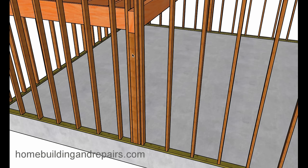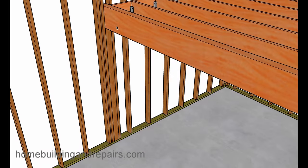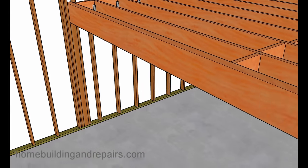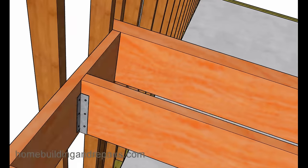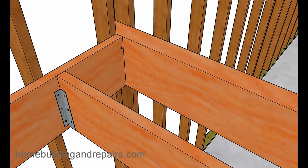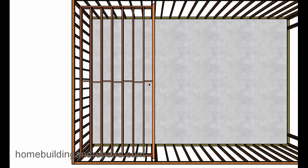You might need a six by twelve, might need a bigger post in here. Don't forget that you might actually need a footing underneath this — you'll see more of that in the next section. Something like this — I don't know if it would require a footing or not; it would depend upon the width of your existing footing. You can see here where the beam is sandwiched in between two framing studs. The ledger just simply butts up against there, and then you could toenail this into the beam and nail right into the framing stud to get a nice connection.